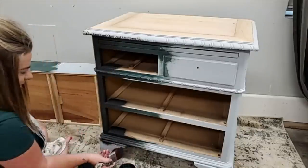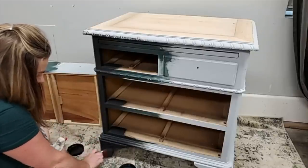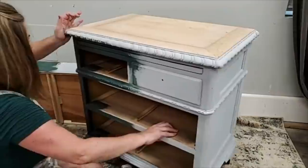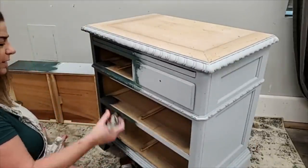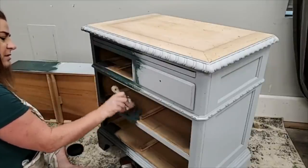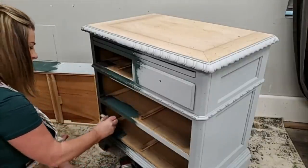I'm going to come down here onto the legs, but not all the way down right now because I need to put this up on wheels so I don't get little carpet hairs in my furniture finish. You guys don't always see me do inside the frame like this, but I always do it — it's going to be blended to match the body so when these drawers go in it looks consistent with the furniture piece.